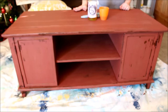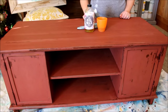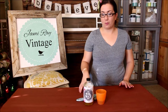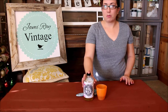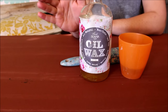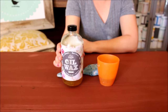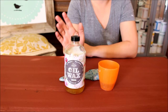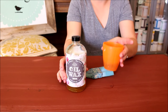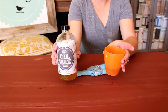Now that all the chippy pieces are where they are and I've sanded it buttery smooth, I'm going to go ahead and seal it to protect it. Milk paint is porous so you need to seal it with either a wax, a polyurethane, or something, because it won't be protected otherwise. I am using Sweet Pickens oil wax. Oil wax is a non-toxic wax that is liquid — kind of like a cooking oil — but it dries hard and will dry to a satin finish, or you can buff it to get a higher sheen. First you need to brush it on, so I poured it into a separate cup so I don't contaminate my oil wax container in case there are any chippies I don't want getting into my wax.